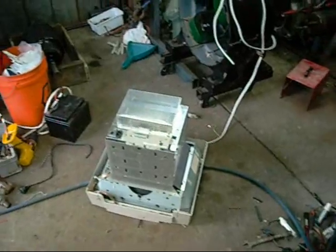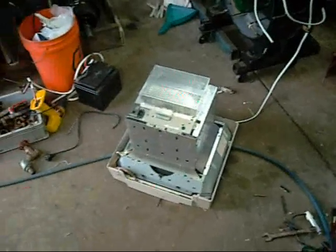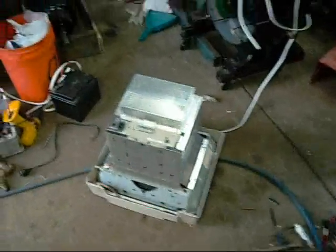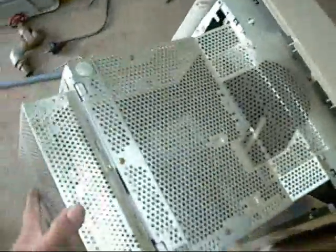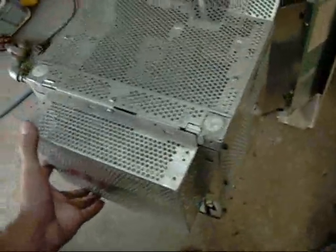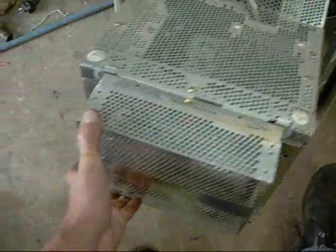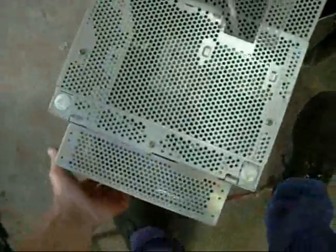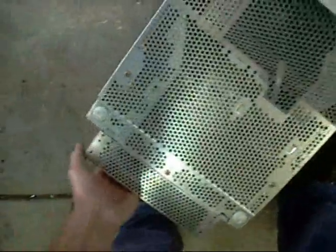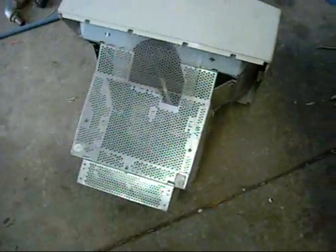This is what I like about old Japanese equipment — this was made in 1994. This is why it's so damn hard to carry, because it's covered in sheet metal: RFI and electrostatic shielding as well as grounding sheets. All this has a purpose — it's shielding against external interference, preventing interference to other things around it, and shielding against electrostatic discharge.